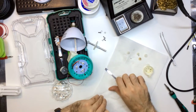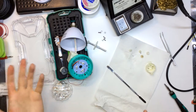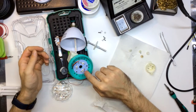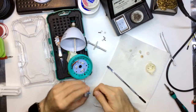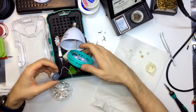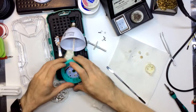I'm gonna have to take some voltage readings because the motor is rated for 3.0 volts to 9 volts, and a red LED typically illuminates at 1.8 to 2 volts. So that may also be the problem, that the LEDs being mounted... Oh wait, no, because we just discovered that that's not the red LED. What was that? The green LED? Oops. Oh, there's something I'm going to have to repair. Did I do that? Well, I guess I'm gonna have to fix that too. So we'll just desolder the motor while we're at it.